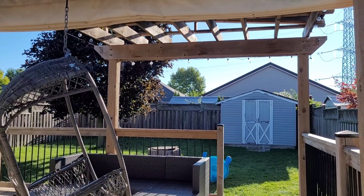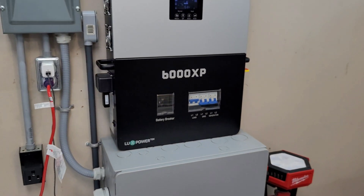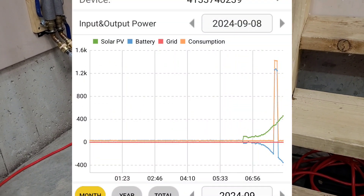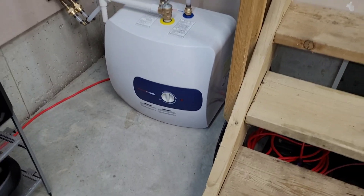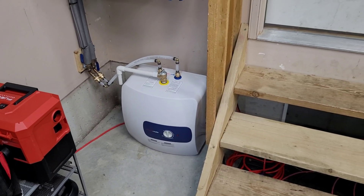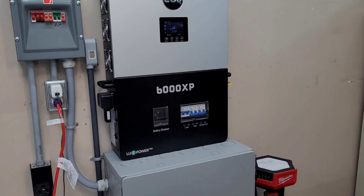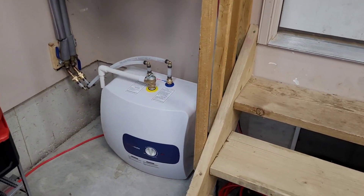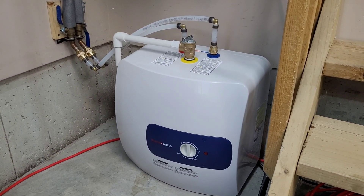It's the next morning and it's looking like it's going to be a really good day for sun — we're already making 850 watts. The water heater did really well last night. We're sitting at 78% state of charge. The water heater ran its last cycle at 9 p.m. and didn't run again until 8 a.m. this morning — so it went 11 hours without having to reheat the water. It held heat a lot better than I thought it would for a small water heater. I thought it would be bumping the element every couple of hours to maintain 125 degrees, but it actually did really well. For the next test I'm going to try to get a shower out of this thing.